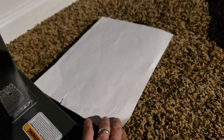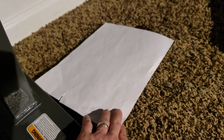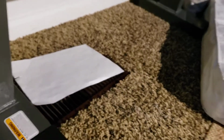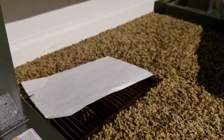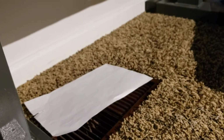And now the reason that it's lower, and the reason it's more upstairs. Now I've got all the vents upstairs closed, all of them, to see if we could increase the airflow down here, before I realized that there are so many gaps and air leaks all along the whole duct to down here. But that makes sense that it's so much hotter upstairs, even though those ducts are closed, because of the air that is billowing out of the openings where the AC goes in and out. The AC connections go in and out right above the furnace itself. And I'll show you those.